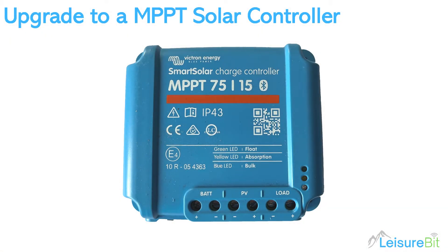The next power gadget is the MPPT solar controller. The difference is that standard solar controllers are PWM — pulse width modulation — which provides a reasonable power output. But MPPT generates the maximum potential from the solar panel — hence Maximum Power Point Tracking — so you get the most power out of it. It's a more advanced way of working.